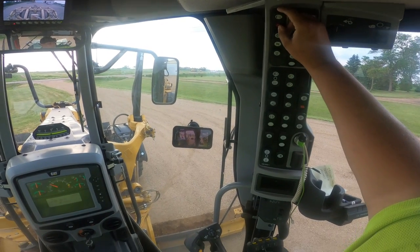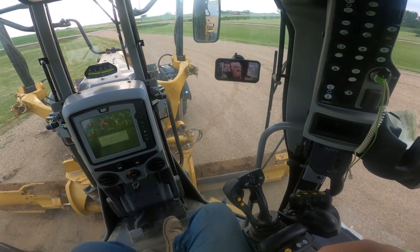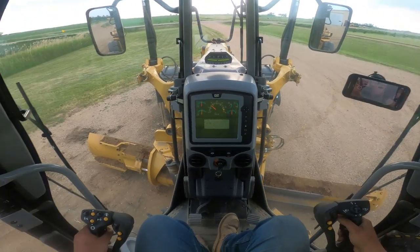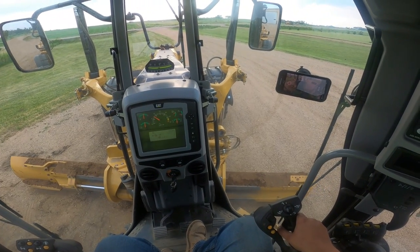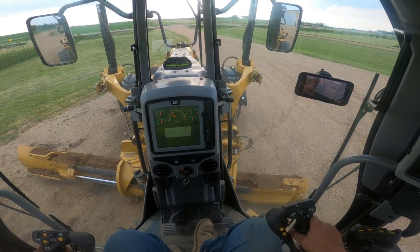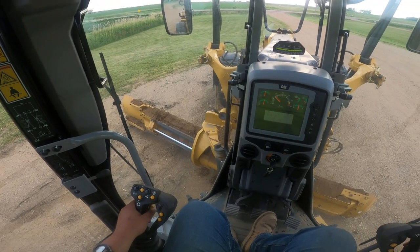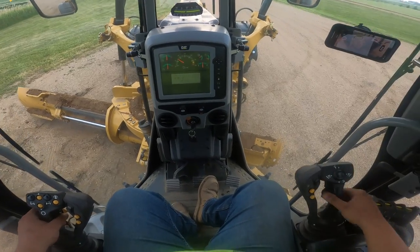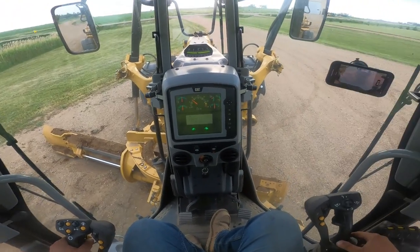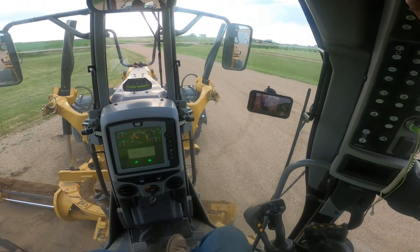This is your draft link unlock switch for your saddle. What I like to do is slide my moldboard all the way to the left, and then take my circle side shift all the way to the left and kick it into float.